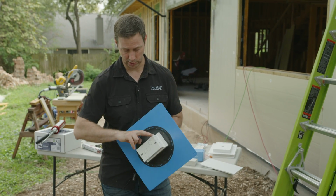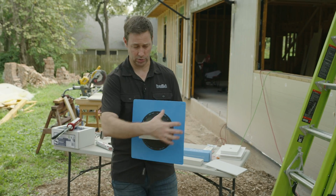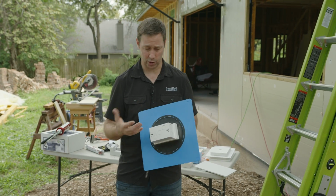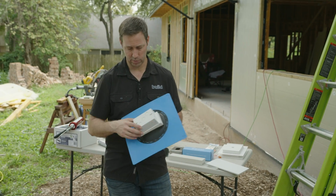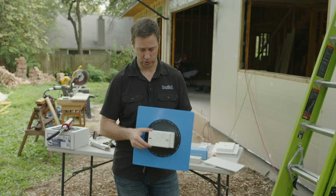You'd wanna use a piece of Siga tape or maybe a piece of zip tape. In the past on some videos, I've shown some closed cell foam and making a big kind of cow patty of closed cell foam. That could work as well, but I actually think I would prefer the tape method these days. I think that would really air seal this really well.